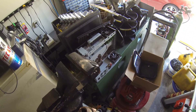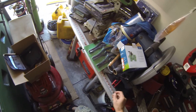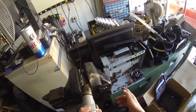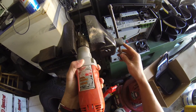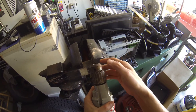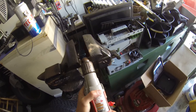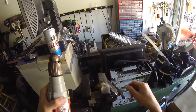This is your allen bolt. Some chucks loosen up easily, some are really tight. When they're tight, you can use a pipe for leverage — but don't use a regular hand or pipe wrench, it can cause accidents. To remove the chuck you go counterclockwise. This one is already loose, so we're lucky today.